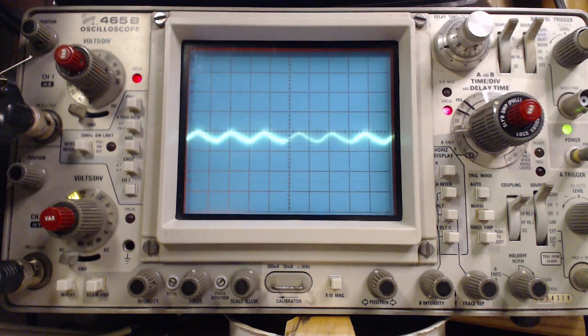The only reason they don't have 1000 in there now is because it was cheaper to do 500. They can get away with it. So economics are always pressing down on everything that's being done in these sets. So smallest capacitor possible, especially an expensive part like these capacitors. They're quite interested in trying to reduce them, and physical size and weight and everything. So I need to augment that. Do I need to replace it? I don't think so.